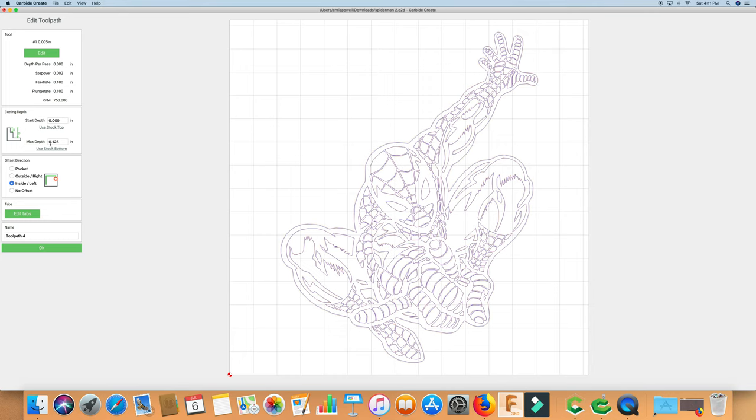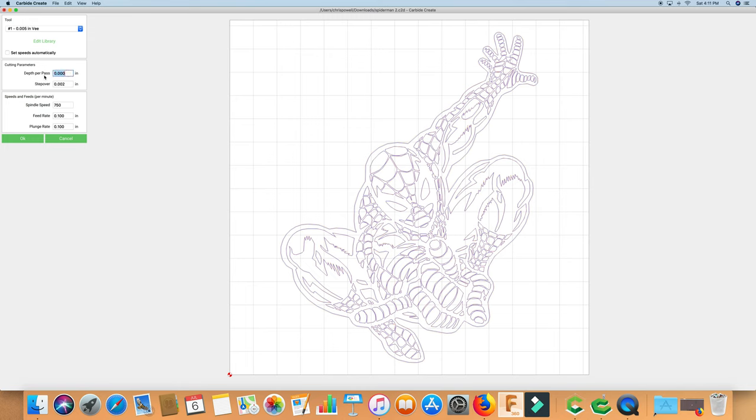So again, we've got our max depth set to an eighth of an inch. We'll come back in here. So depth per pass, we'll set that to our eighth of an inch. Step over, we'll set that to 0.005. Spindle speed doesn't matter because we're not going to be running the spindle. Feed rate, let's set that to 60. And plunge rate, we'll just set that to 30. I'll put all these numbers in the description too, so you guys can go and check back on that later. So we'll click OK.